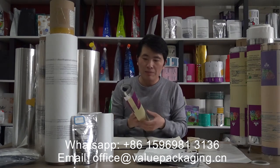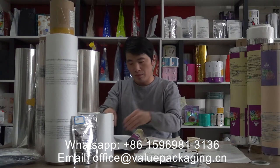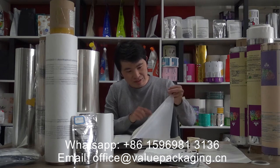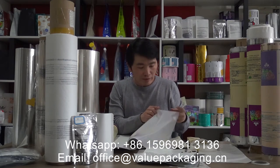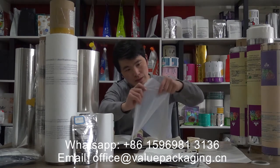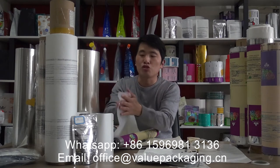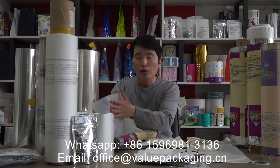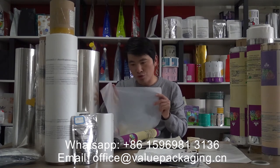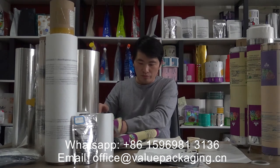The third film, PLA plus PBAT, is a blended film — actually a mixed film with some opaque effect, as PBAT is totally white. When the film is produced it has a milky effect, not fully transparent. This film is soft and usually works as the inner layer for sealing purposes, able to achieve very good sealing strength compared with traditional packaging.